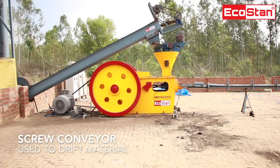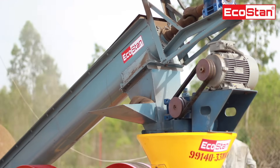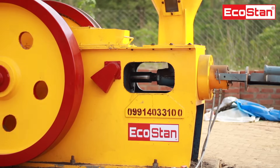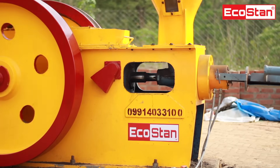Then the dried material is picked up by a moving screw conveyor to the briquette machine. The material is fed into the hopper, which supplies the material to the feeding chamber. The briquettes are formed in the feeder box — it compacts the raw material by high-pressure mechanical punch.